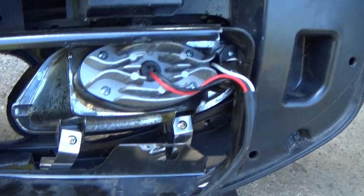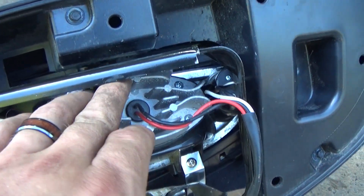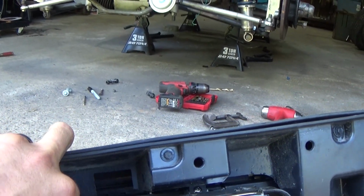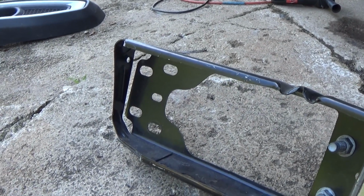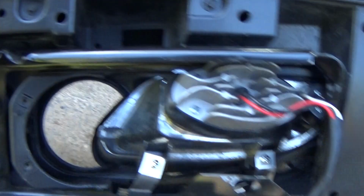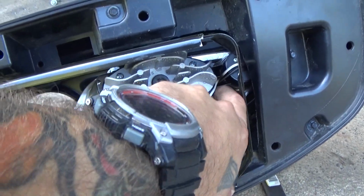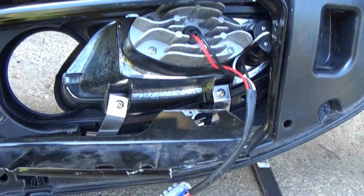So this is what I have as far as the fitment on the right side headlight inside of the steel bumper. There was a section that I had to trim out there so that I could get everything to fit because of the depth of these cooling fins back here, which performance may not be the greatest there. There's still a little bit of clearance, but it misses. So that's that section that I cut out on the right side. I tried to cut out as little as I possibly could so I could still have something to tie all of this together, but just feasibly I wasn't going to be able to do that without wires getting really close and just constant adjustment and refitments. So that's what I've got for the right side.